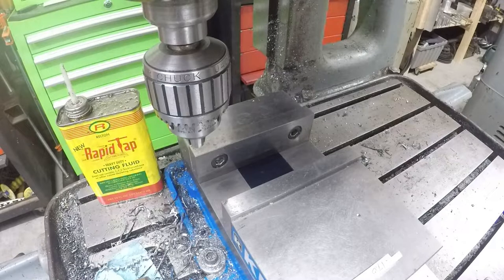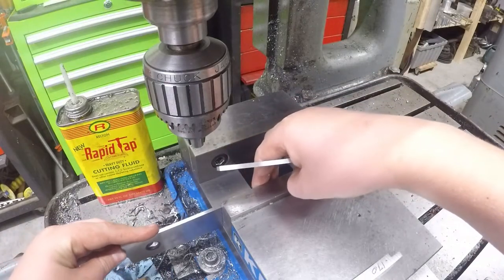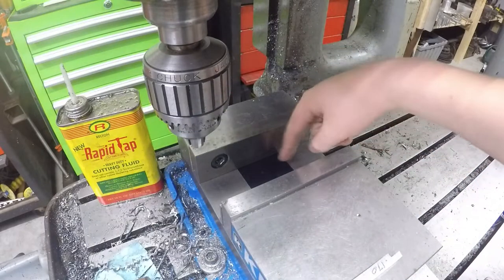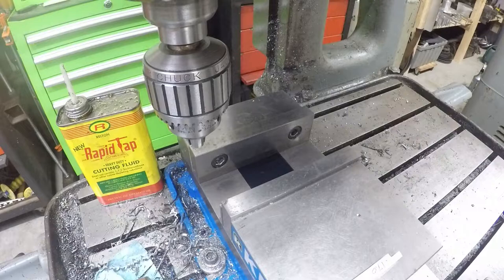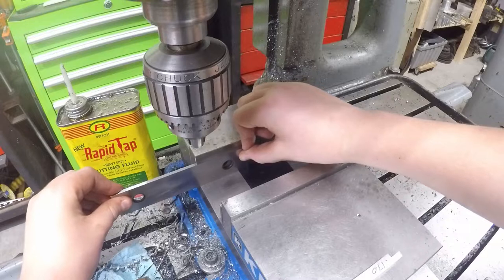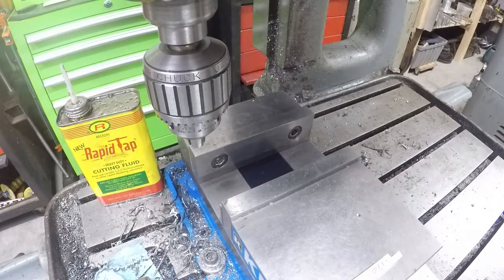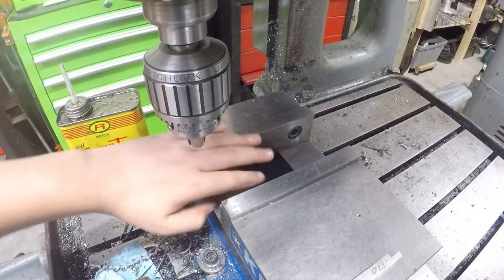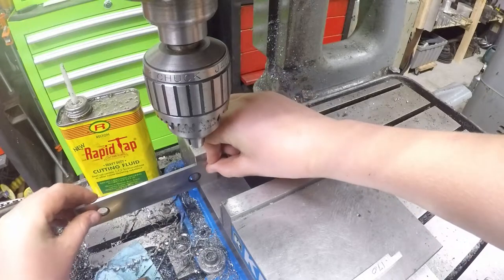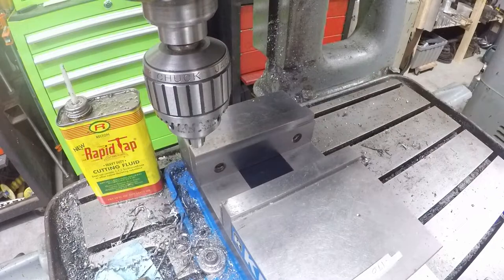All right, so now we've got our parallels, and we're going to go ahead and slide these in. You want to make sure you keep even pressure across them and just slide it across. If you feel a bump when you get to an area, chances are it means you have a burr, a chip, or something in there prohibiting you from sliding your parallel in, which is not good — you want to get rid of that ASAP. In my case I had something, so I went ahead and wiped off that area because I had a burr there. Now it slides right across — chances are we had a chip or something there.